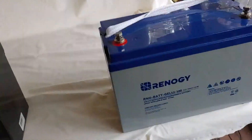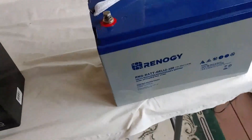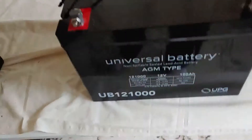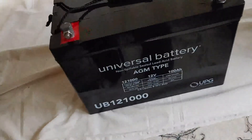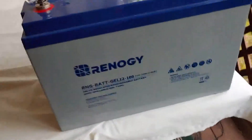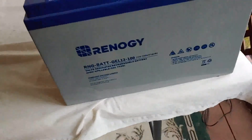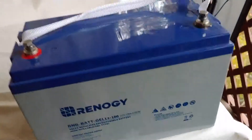The cons: very expensive — much more expensive than an AGM battery. I have also found they are difficult to charge. With an AGM battery most battery chargers now have a setting for AGM, and of course the regular setting for a flooded battery, but gel batteries are a little more difficult to charge. Some charge controllers are coming out — especially Renogy, like this one I have here — that have a gel battery setting specifically for charging. But they are more difficult to charge and you should know that.